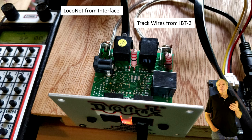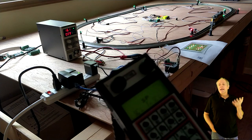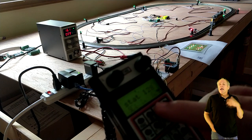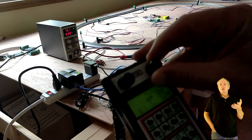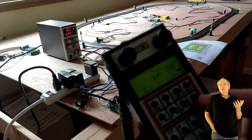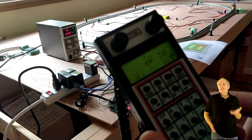That's it if you are running your LocoNet throttles with a battery installed. Otherwise, we also need a LocoNet panel in order to power the connected LocoNet devices. We connect the back side of the panel to the track output and connect LocoNet to it. Now we can connect a throttle to LocoNet and it works just like any other LocoNet command station. We can assign a locomotive, control speed and functions, add and remove locomotives from consists, and everything else you expect to do with a command station. Furthermore, we can send switch commands to operate turnouts, and using other control devices like a yellow hat or JMRI on a computer, we can also send signal commands.